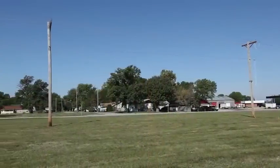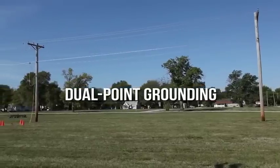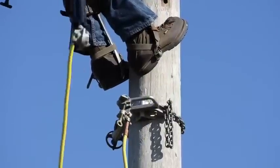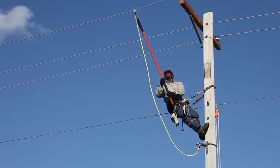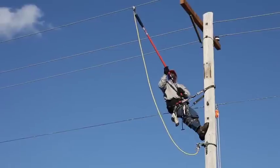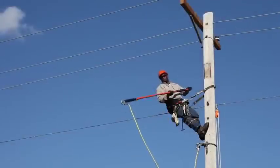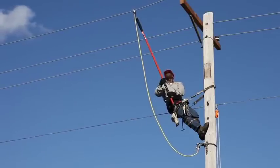This establishes what's known as dual point grounding for the work site — the pole in the middle. Grounding at the work site begins with a cluster bar. The temporary ground being installed here at the center pole, the actual work site, is known as a personal ground. It begins with the pole, which must be considered conductive itself, and connects from the cluster bar to one of the phase conductors. The personal ground forms a fault circuit path from the phase down the pole and thereby creates a zone of equalized potential above the cluster bar. Now he's protected to perform the maintenance this service call required.